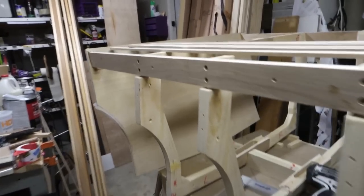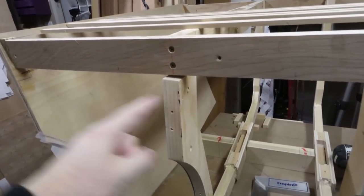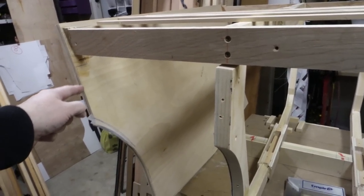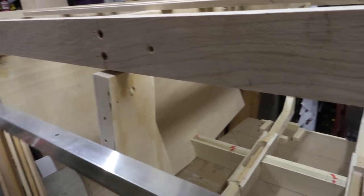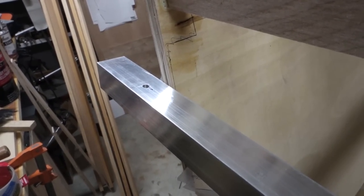An eight-foot piece — I'll have to chop off here. I'll extend this block on both sides so I can tie it, or actually I might just extend it on this side so I can go from the transom to here with no issues. There is a space differential between the transom and the first frame, so I think I need to build this bit out. As I place this piece of wood across the frames, I can see I'm just over a sixteenth of an inch shy on matching up with the transom.